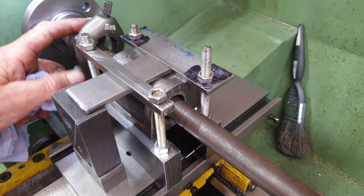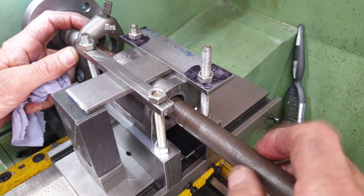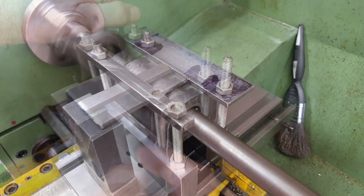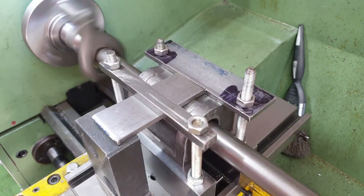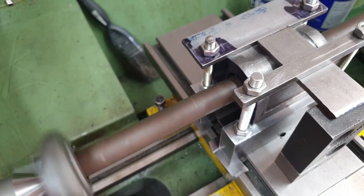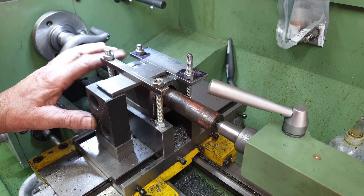I've got a boring bar on the lathe between the centres. This is the first of two — just to get the cylinder bore large enough to move on to my other boring bar which is a larger diameter piece of bar. The tool is here — a carbide tip, one of the budget ones. I'm using the power feed on the saddle and I'll run that all the way through. There's little point in boring you with video of the saddle traversing as I open up the bore in the cylinder block.